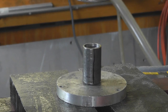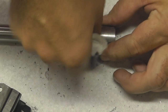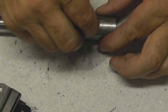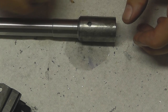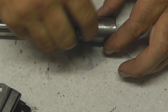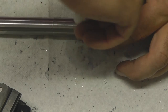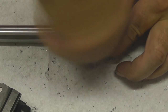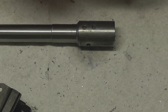Let's take it out, take it back to the workbench, clean it up, and get ready to weld the sleeve in place. If you have brake cleaner, that would be better — I'm going to go look for a can and spray the anti-seize out of these holes so you get good contact when you weld. When I weld, I'm going to use my MIG welder, place the wire dead center of the rosette weld hole, and fill up these holes. I want really good contact with the barrel itself. The localized heat from this small amount of welding isn't really going to hurt the strength of the barrel at all.